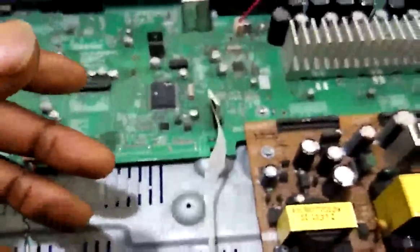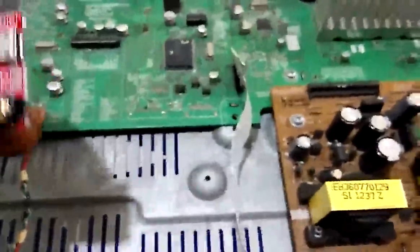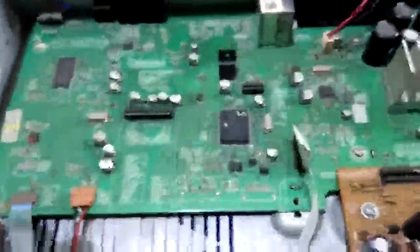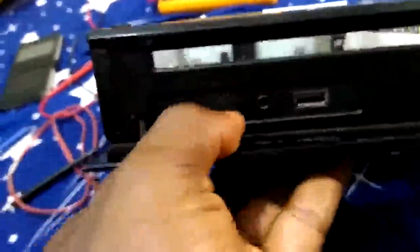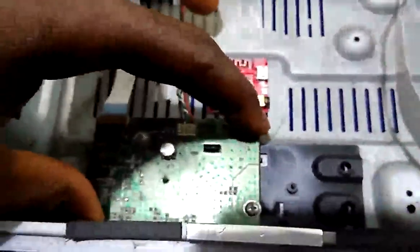After opening the DVD player, I removed the CD parts. This is the Bluetooth module — I think I have to install it here, but for this purpose I will be connecting it to this part, which is the portable input. I'll draw my 5-volt power supply from the USB port, so all my connections will be done from here.